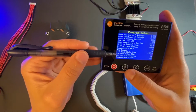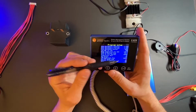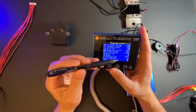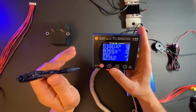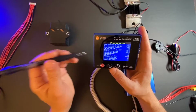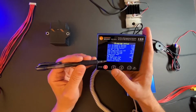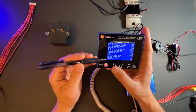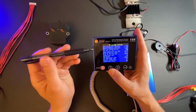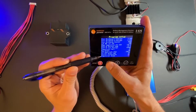Next is cutoff delay time. Before, when we reach any of these settings, any of these voltages, it's going to wait for 2 seconds before it's going to kill batteries, before it's going to shut down discharging. So next step is the current calibration. We're going to do it in the next video. When we have a brand new BMS with a new shunt, we need to calibrate our shunt. So this setting is for calibrating.